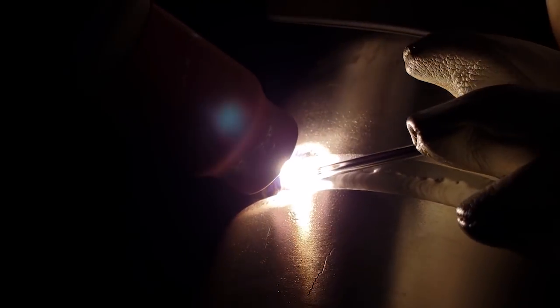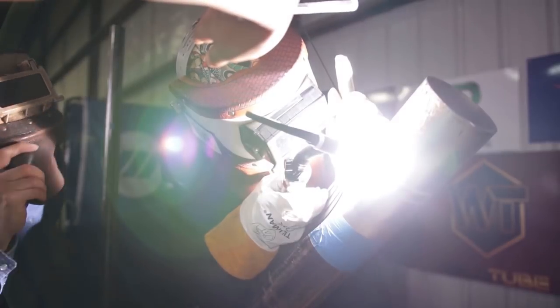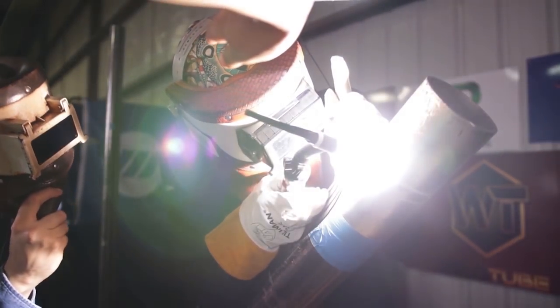When it comes to welding aluminum, there are two individual pipe fit-ups I have been taught. Typically on smaller diameter pipe up to 2.5 inches, you can use a 1/16 land, while for 3 to 12 inch pipe, you can use a 3/32 land for the extended land fit-up.